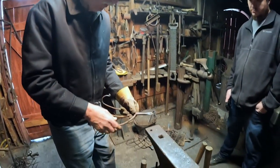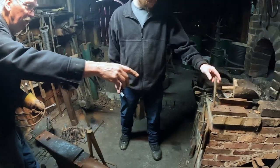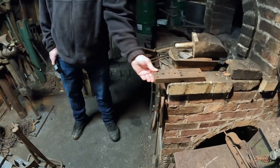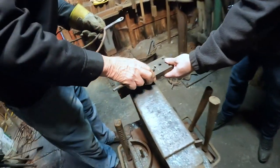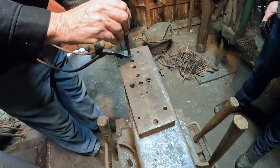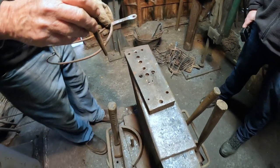It needs to be hot punched. Grab that bar with it, right there. Grab the bar as well. I need to put this piece on my anvil and punch this hot because I can't draw it. So that's the most difficult. The problem is I need three hands.